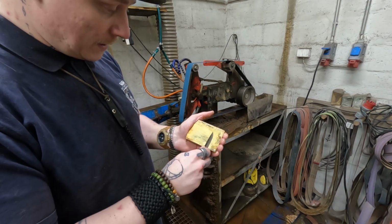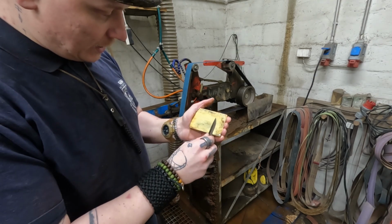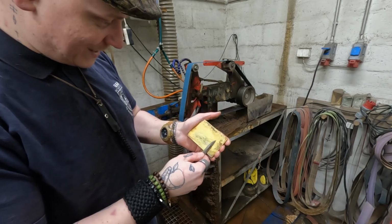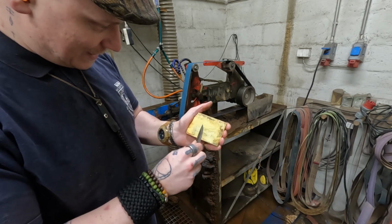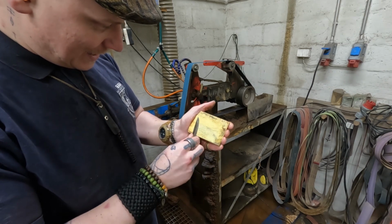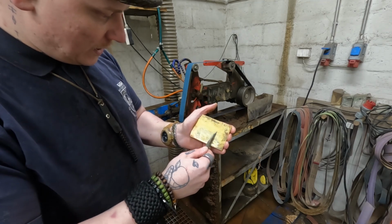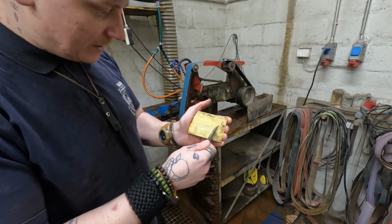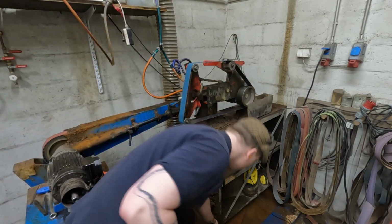Like that. And then what you do when you want to get rid of burrs, you go on one side a little bit, move all the burrs onto the one side, and then you can cut them off like that. We're gonna go on the buffing machine next to clean everything up. But this is just a nice quick way to get rid of the bond that the burrs have against the stone.